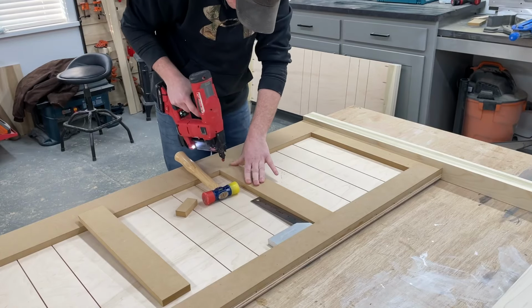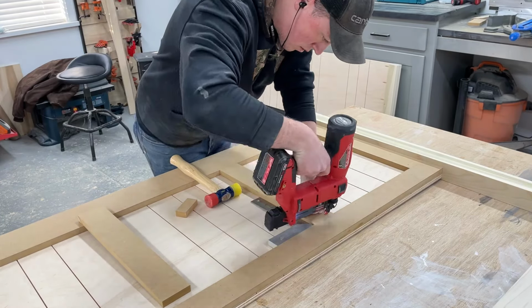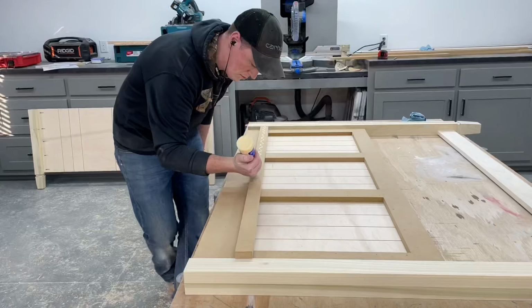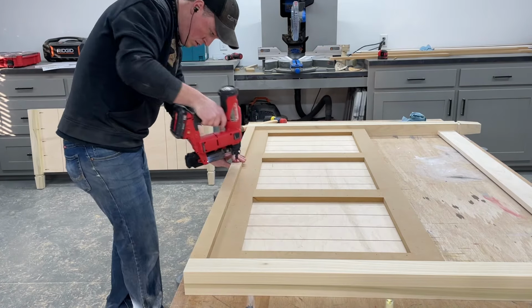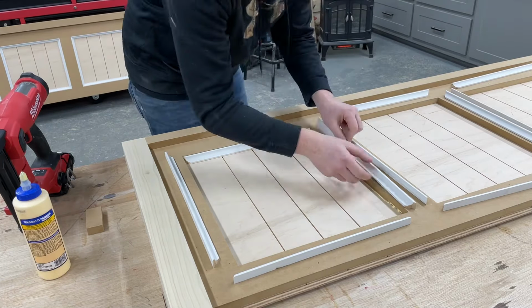This is a really easy and approachable way to do this, since MDF and plywood are inherently really stable products, and we don't need to worry about wood movement as much as solid wood. This last piece is a filler strip, so the crown molding can be flush and wrap around the legs. Next, I could add some cove molding on the inside of the MDF strips.